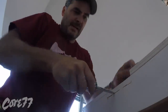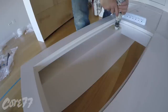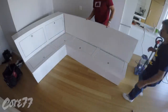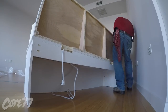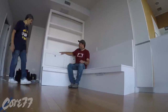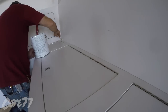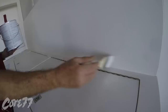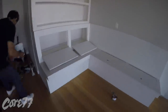I knew I had outlets on the wall but I didn't know exactly where they were going to land — and of course they landed directly on this edge. You see the outlets on the wall — I'm using my little end cutter there, which is a lifesaver on any installation. I'm actually moving all the outlets to that power strip, which you can see in place on the outside up under the ledge. Screwing all my parts together for the final, plugging it in, pulling it in — now we're all fit together tight. That top strip — look at how happy I am — it comes off to access that vent panel at the ceiling. Now for the final touch up, wherever the seams are coming together they get flooded with paint so it looks like one solid piece. We spent some time caulking it into the area making sure everything looks like it was integrated and built in the spot. There it is — the finish — and this was about three days worth of work and about one hour install, and most of the work was on those outlets.